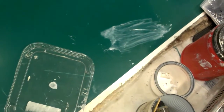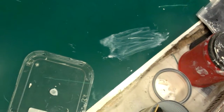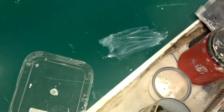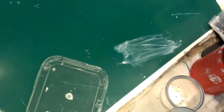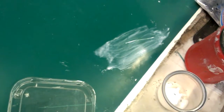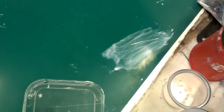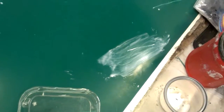So you did this proactively before you had the need for it? Oh no, we had the need for it right away because we picked up and moved all this hardware. You can still see I got all these little pock marks all over my boat, which is with gel coat and doing your deck. A hole like this is where we moved something in the deck. So that's my non-skid pad. It's got silicone caulk all over it right now, but that's a non-skid pattern.